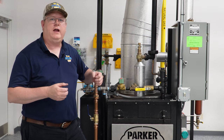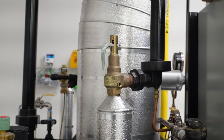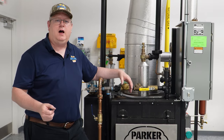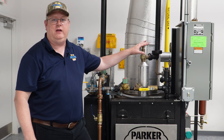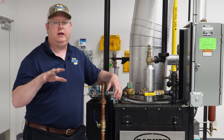On this week's boiler tip, we're going to answer a question about the frequency of testing a relief valve on a boiler. There are different schools of thought nowadays. With modern shipping, ready availability of parts, and good testing and recertifications available for relief valves, it's not uncommon to just operate a boiler through the year and have the relief valves recertified annually.